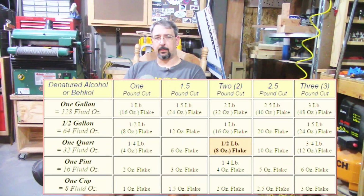As far as the finish goes, I went with a shellac finish. And I used something else I haven't tried before, and it's shellac flakes. I bought this at Rockler, blonde de-waxed shellac flakes. And it really worked out really well. I used a formula that gave me a 1.5 pound cut, and I'll put that formula chart somewhere in this video as well. And if not, I'll at least put the link to the formula chart that I used in the description.